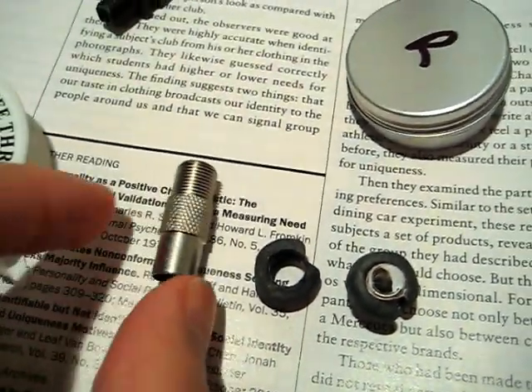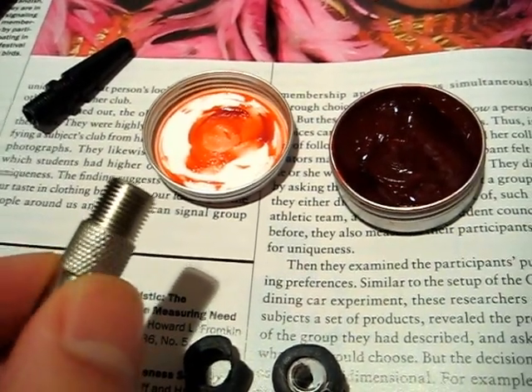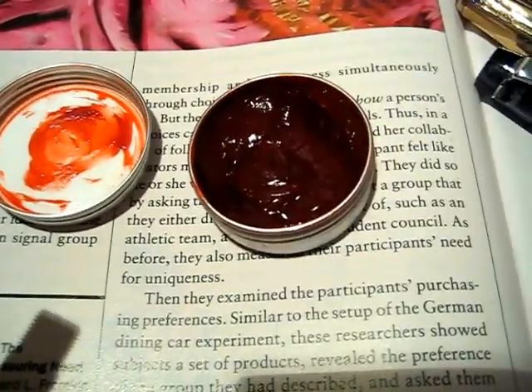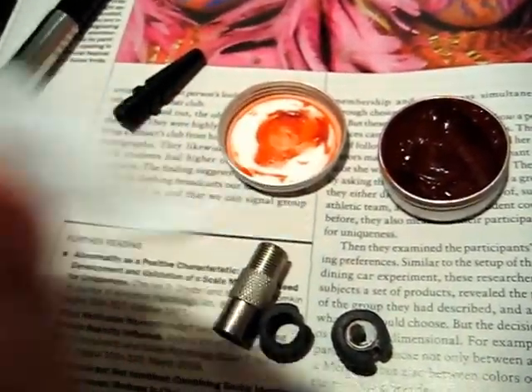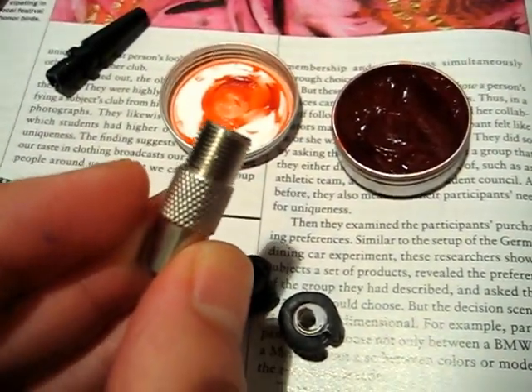The idea I've been going with — I've been collecting a fair few threaded bosses to experiment on before I start subjecting the eyedropper to it. I've been thinking: a little red rubber grease applied to the threads of the boss. That should stop the epoxy adhering to the boss itself, which would be kind of disastrous. So a little red rubber grease, followed by a wrap of Teflon tape. I've discovered an actual use for Teflon tape in a fountain pen! The rubber grease also helps it to stick down and stay in place, while still giving enough of an impression of the threads for the epoxy to take.